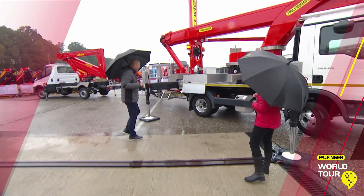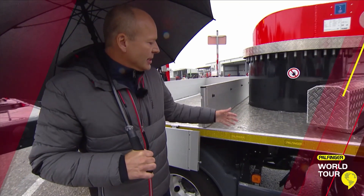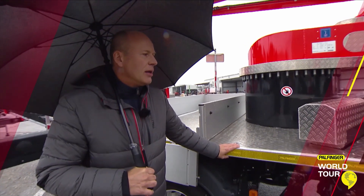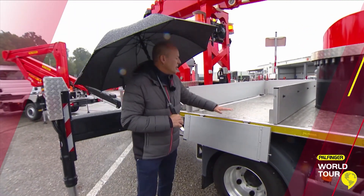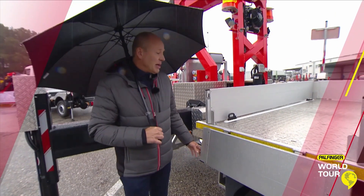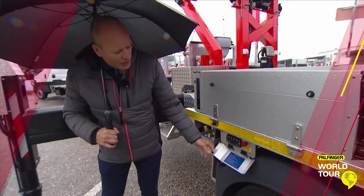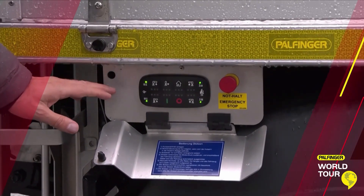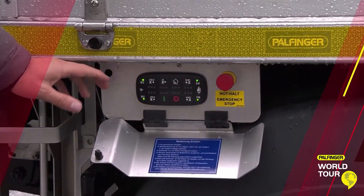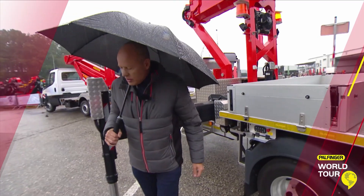Here, just to show you some more details: there's aluminium coverage with special nuts where you can exchange this. So for hard working conditions, if this is damaged, you can replace it very quickly. We also have the bordering with new air rails and fittings where you can fix your stuff much better than in the past. We can also see here the new outrigger controls, which we took over from the successful controls used in the PS370KS and the Light NX class. With those, you can very easily operate the outriggers — move in, move out — and you have a home function. All nice features are in those controls.